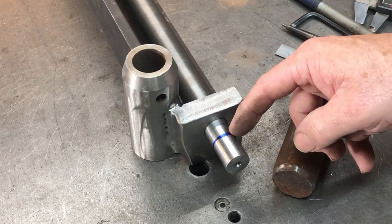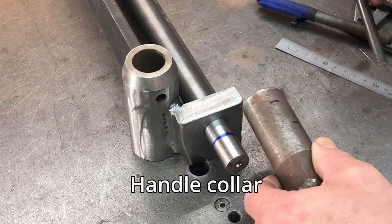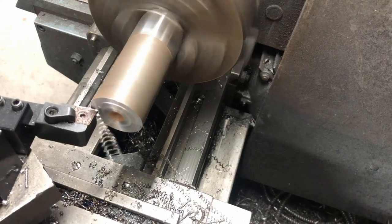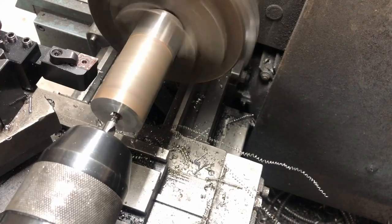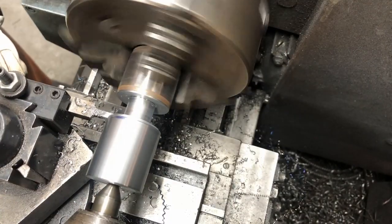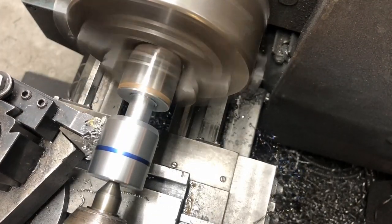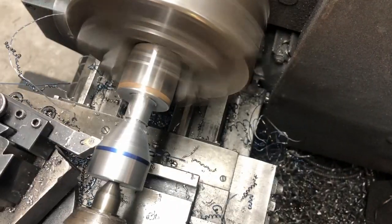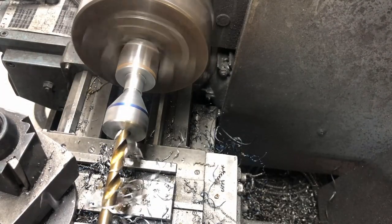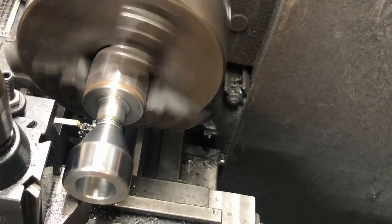Now I need to cut this piece off where this line is because it's a little bit long, and the next step is to make the handle part that goes onto here out of this piece of steel. I'm cleaning up the end from the lathe and then cleaning up the surface as well. I'm cutting a big groove in here because I want to put a taper and do this all in one setup. Then I cut that taper in there — doing it this way allows me to drill and bore out the hole at the other end where the tail stock is. We drill and bore that out, give it a clean up with sandpaper, and the final step is to part that off.